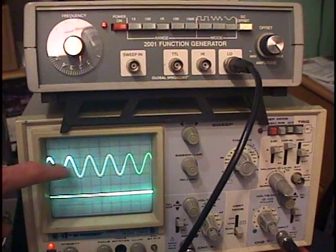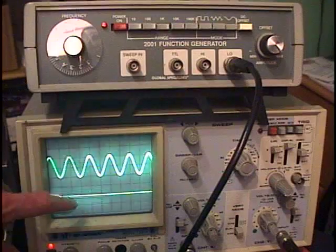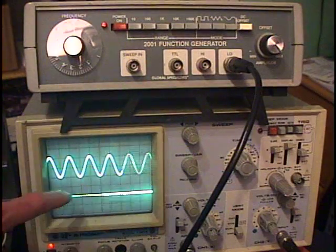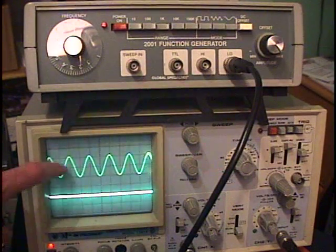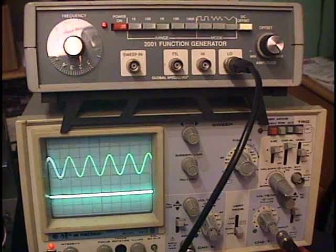When we tune the GR 700, it's going to almost exactly sync up with the top waveform. It seems like it's just a little bit higher output as well. We want this bottom line to have the same amount of output as the top one, so let's work on this procedure — this is tuning and calibrating the output of the voltage controlled filter.